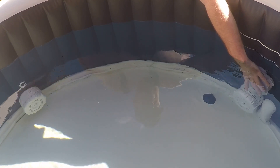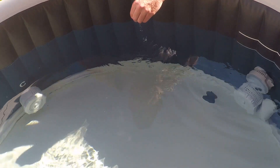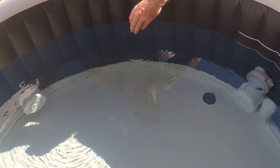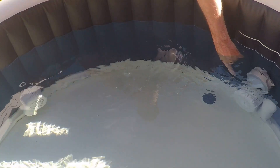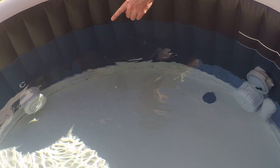That means the main drain located right here next to the light gets approximately 80 to 90% of the filtration debris versus the main drain located further away — simply because this one is closer to the pump and gets more flow.